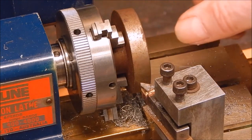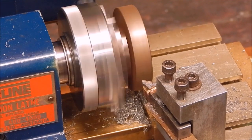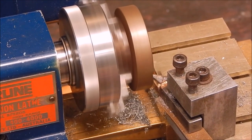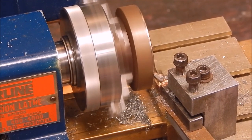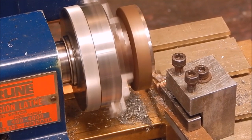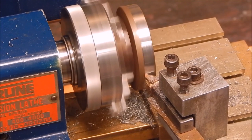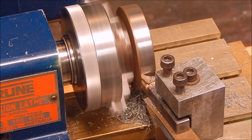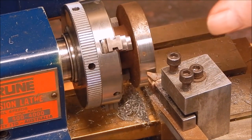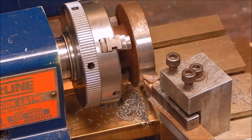All right, we'll try a bigger diameter job, mild steel, change the angle, so we get enough clearance on the cross slide, and I'll knock the speed back, so we'll give it a go. Clearance, we just touched the cross slide. That's the trouble with bigger diameter stuff on a Sherline.